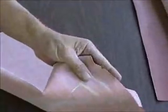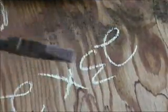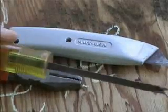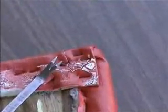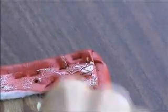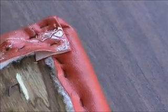These are our main stripping tools: a pair of wire cutters, wide nose pliers, a sheetrock knife, and a professional staple and tack puller. Use leverage against the wood to remove tacks and staples. Let your tools do the work rather than struggling to pull a staple straight out.